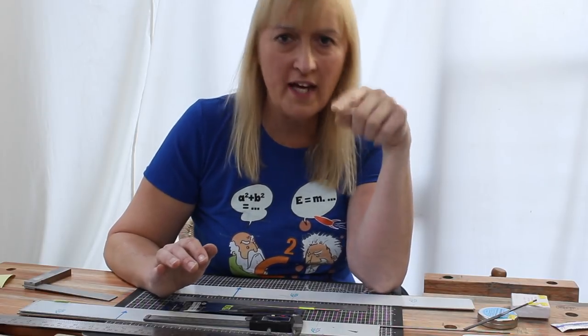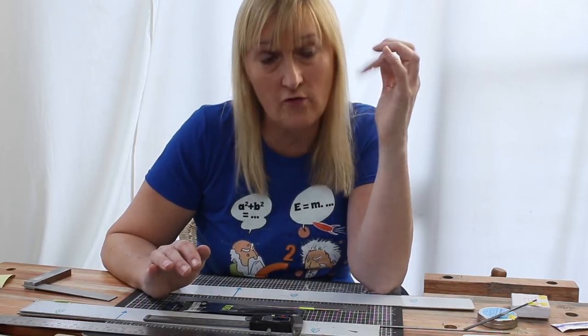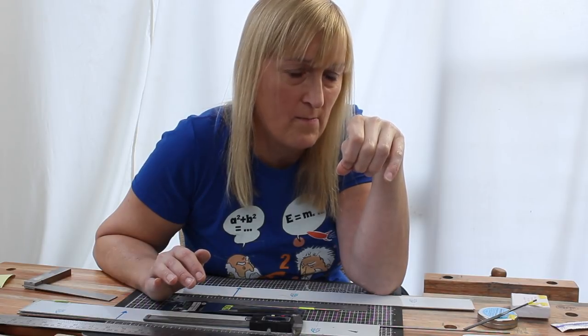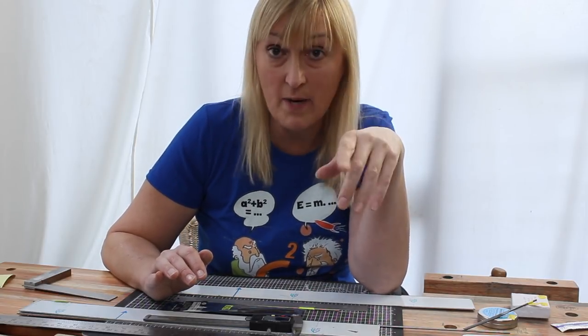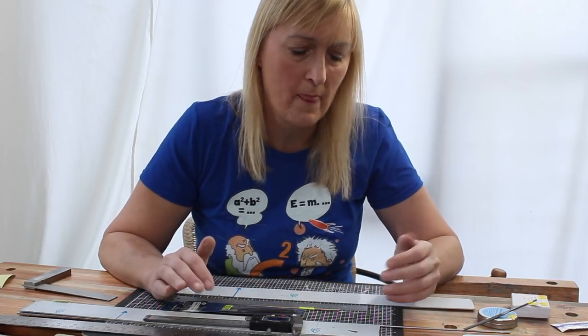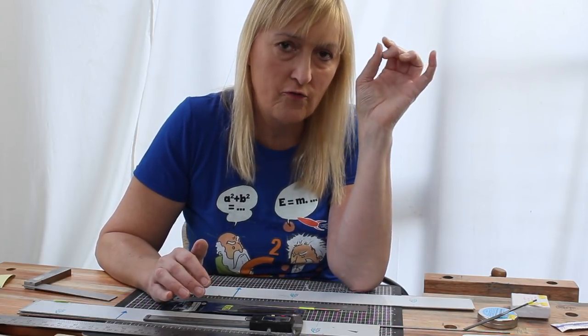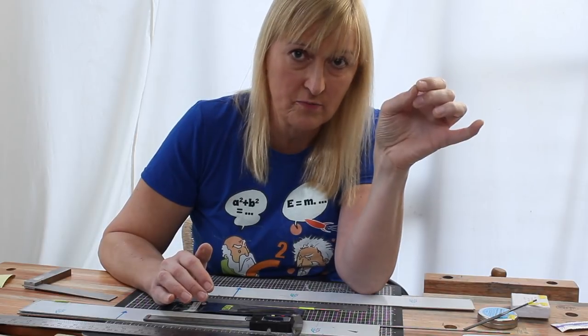And then we take the capo off. We then have to consider what happens with the open strings, because the fretted notes, when you fret a string, you very slightly raise the pitch. Okay? Which doesn't happen with an open string. So compared to the fretted notes, the open strings are very slightly flat. And this is only a few cents, but it is measurable. And this is what a compensated nut is trying to correct for. What you do is you bring the position of the nut forward slightly to sharpen the open strings.